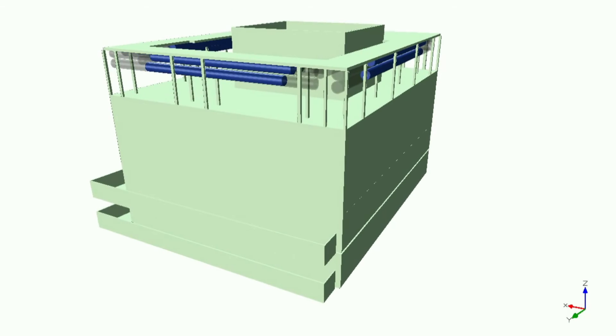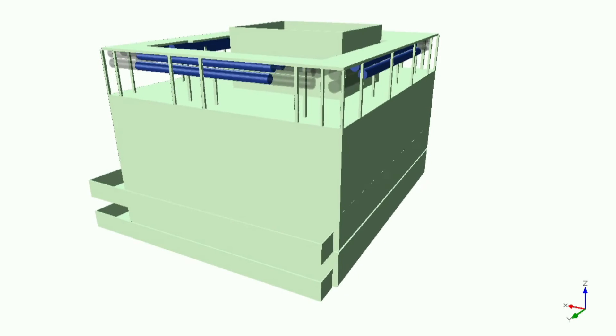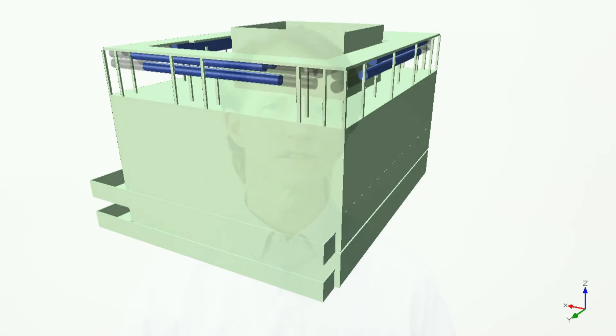The Hummingbird is also a good retrofit option. Where a building has had a cladding overhaul, modern cladding systems tend to not give as much damping to the building — they're higher performance in other ways — but now might be a great time to put a Hummingbird system up on the roof and get that motion back under control. This reduces the number of days that occupants feel motion or elevators have to slow down due to cable movement.